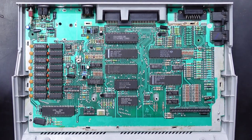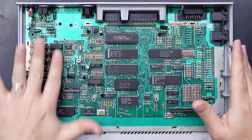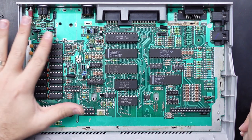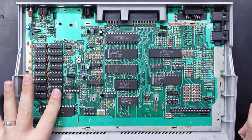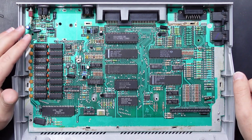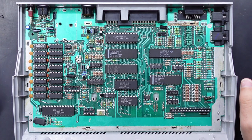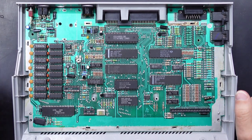Our RAM's in. Now obviously if you don't have a board that has the spots for the RAM, this upgrade may not work. I think there are some models that don't have the spots for the extra RAM bank — some models use 4-bit 64 kilobit RAM chips, so you've probably only got two of them rather than the full eight that we've got here.